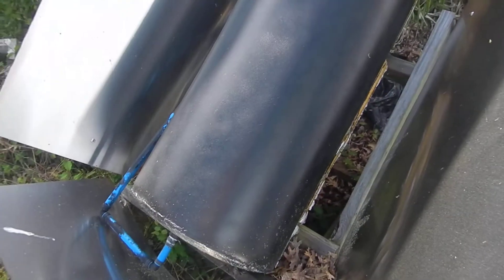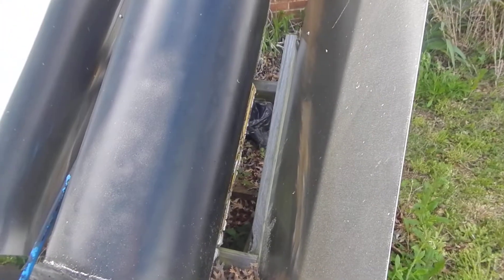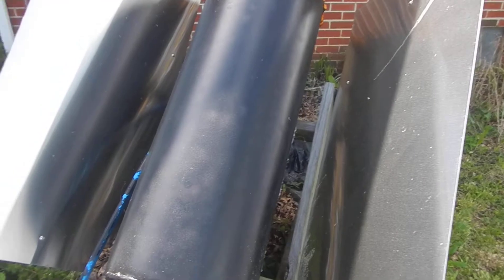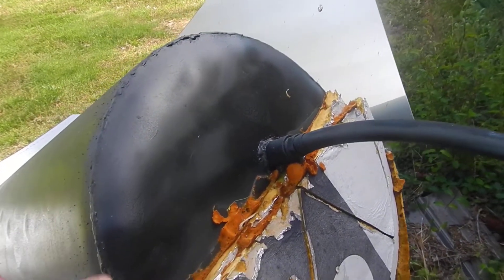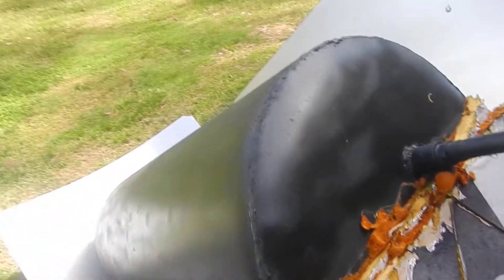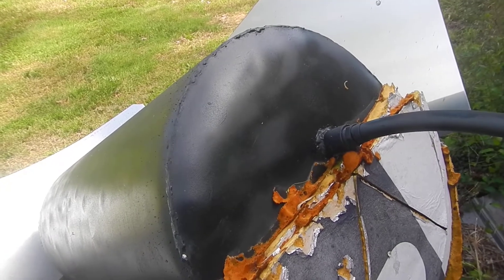When it gets hot — like 90 degrees outside — it'll be up to 130 degrees at the top of that tank. This tank is something I made myself. It's all stainless steel and has one outlet. It's important that you leave a space for air in the top of the tank, so as the water heats up it has a place for that pressure to go — the air can compress and handle it.